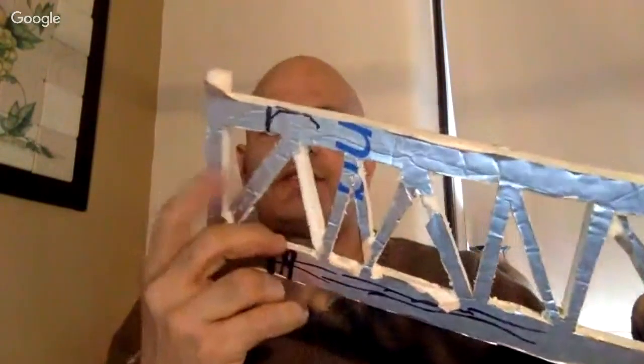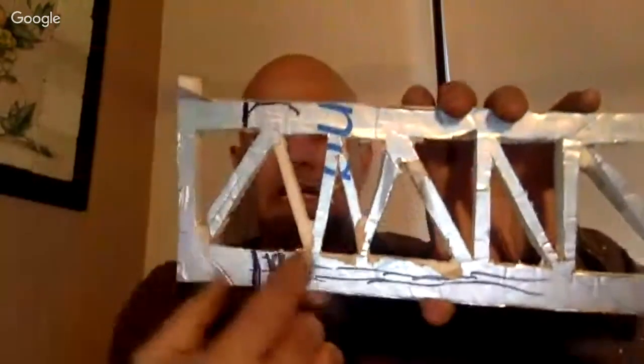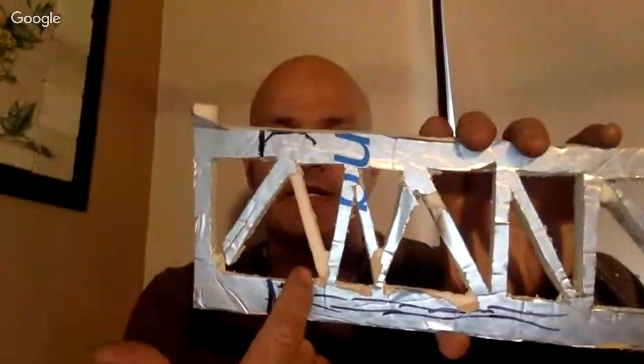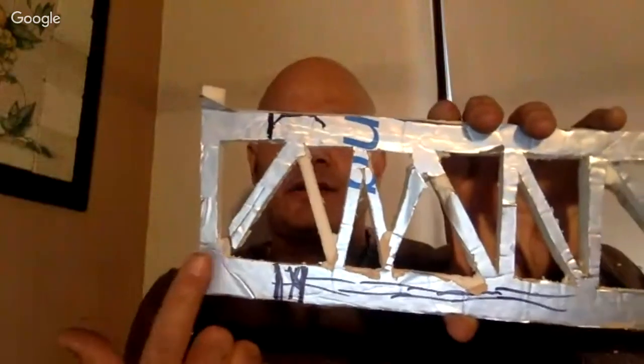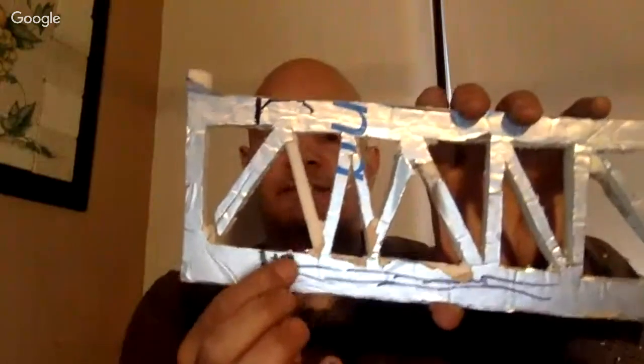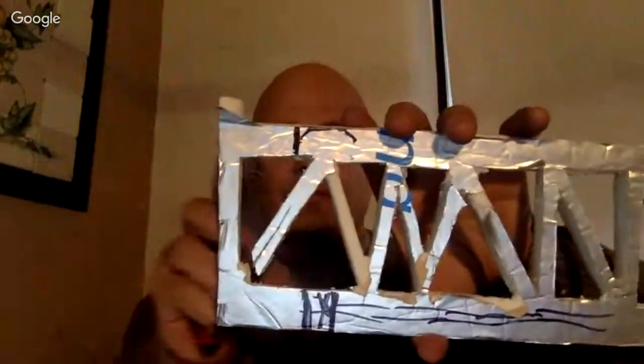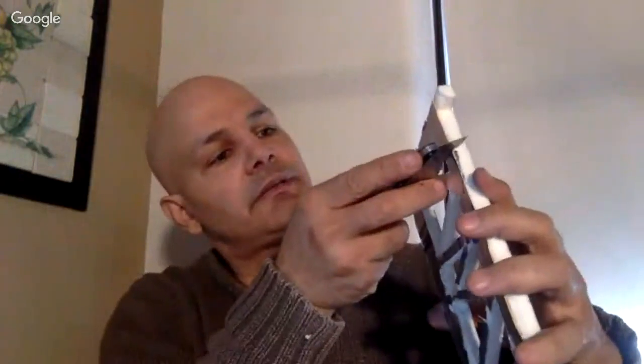Hope that was fun for you and helped you understand how the loads transferred from 10 over to here, from the top of 10, 11 over to here, and how they resolve themselves with the node and resolve themselves between here and here. And it chose right about there to break, somewhere about there, breaking together. Let's call that the node.